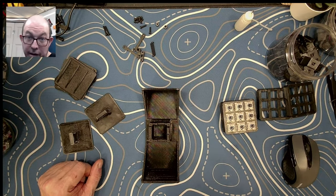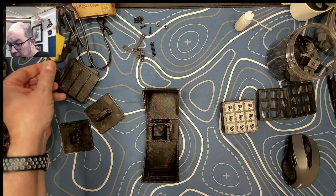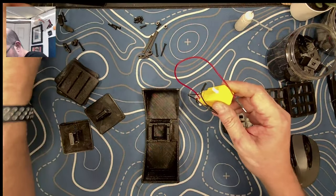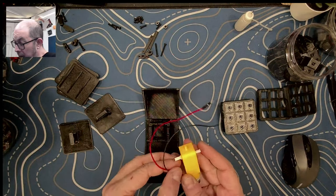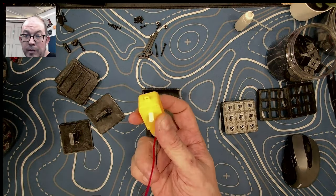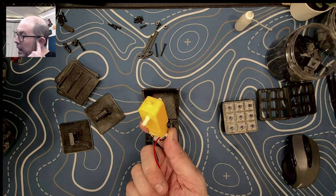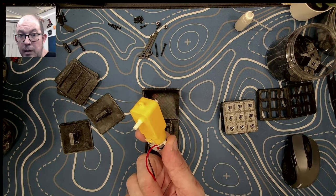So right now I currently have two running. I'm using the 1:48 gear ratio motor that I purchased off of Amazon. That's these motors right here. Sorry, trying not to make a mess, but I got a bunch of little parts. And this is the motor that I'm running. One rule of thumb, I'm not running it for more than 6 hours at a time. And it is roughly doing 40,000 actuations per hour.